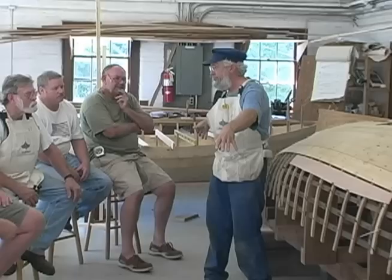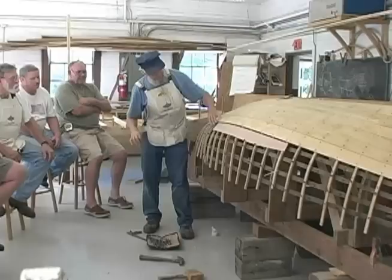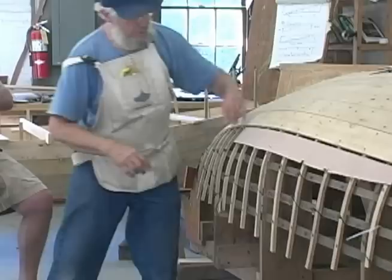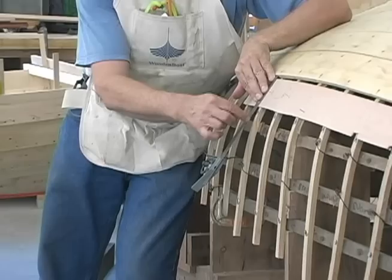Then you'll nail this down on top of your cedar. So take it off, nail it down on top of it. And that'll be the whole run all worked up. That's all these things glued together with the vessel. So you've got this tacked down on top of it. Then you go back, remember these nice lines, where you record this stuff on these lines. You then take your straight edge and carry these lines out onto your cedar stock, top and bottom.